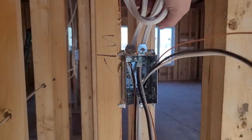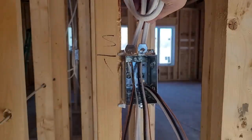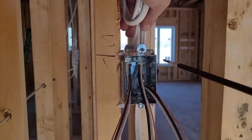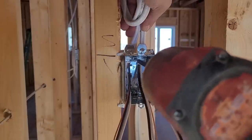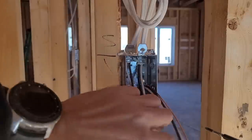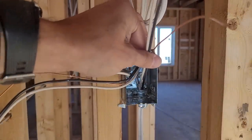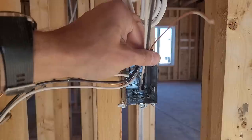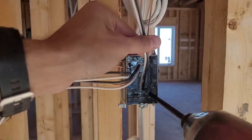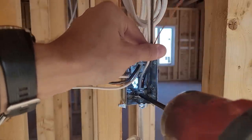Inside the box it's a little bit difficult to work with while filming, but I want some of that white insulation a little bit deeper in the box there and I'll just tighten up this screw — not super tight but snug so the wire doesn't move. Same thing on the bottom one. I don't want the tab digging into the wires, so make sure you can see a little bit of white insulation showing — that's what I want tightened up on the tab.